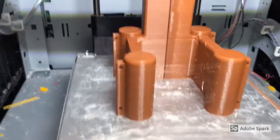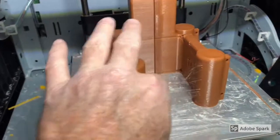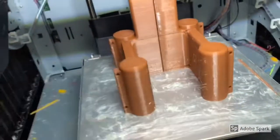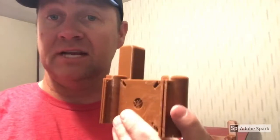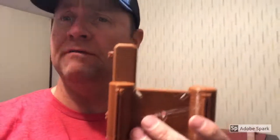I've been at work all day and the plastic came out great. There's some stringing but that's the printer's fault — I can't blame the filament for that. Pretty happy with this; it looks fantastic. I haven't cleaned them up yet, and the flaws I'm seeing are directly related to the printer. The plastic itself really came out nice. I printed at 205°C with 50% infill.